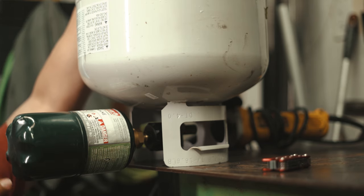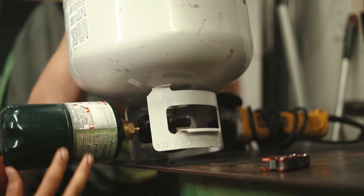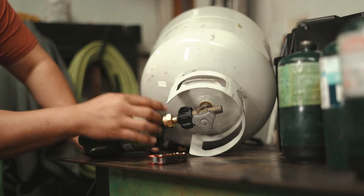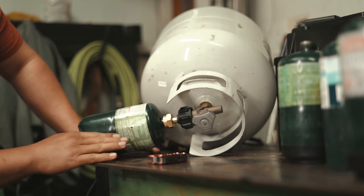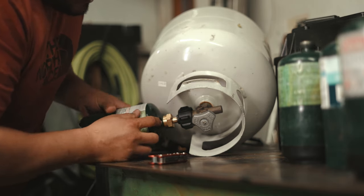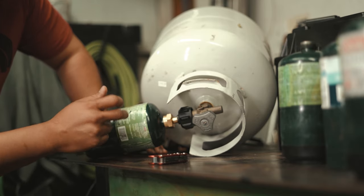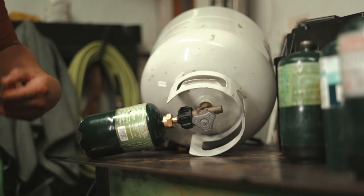So now what we need to do is tilt this over so that more liquid can flow into the tank. All right, so this is probably the angle you want. So liquid is filled, hopefully, above this stem, as well as flowing down and into the bottle. Now your release valve needs to be at the top, so that when you release it, all you're releasing is gases and not liquid. This is gonna be super complicated to kind of film and do, but let's give it a shot.